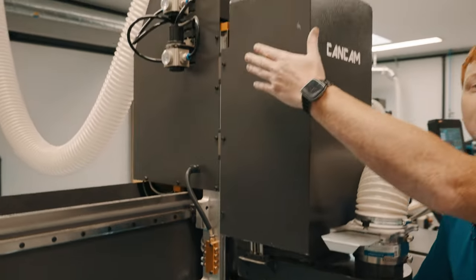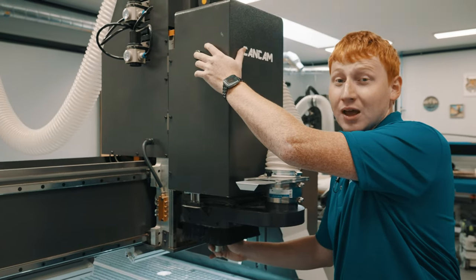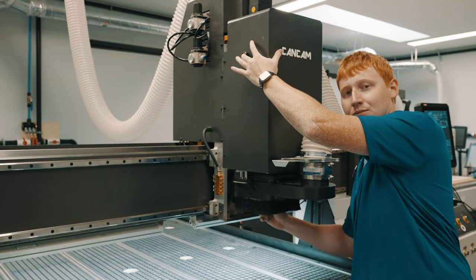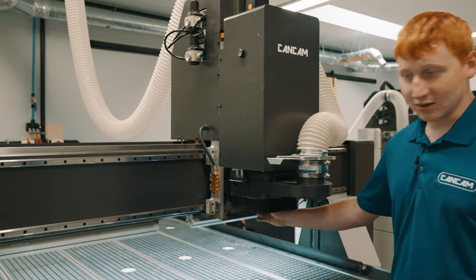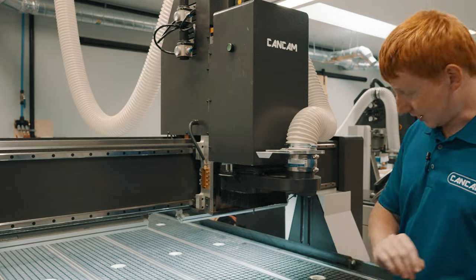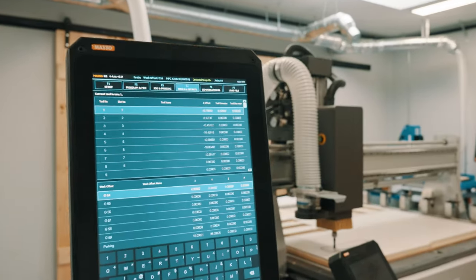and press the green release button on the side. You will need to hold this button until you have inserted the tool fully and then release. Once installed, make sure it's fully seated by pulling front to back, left to right, and spinning the tool. From here, we're going to move to our F4 tools and offsets page.